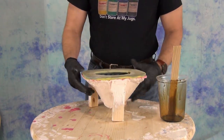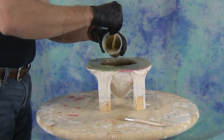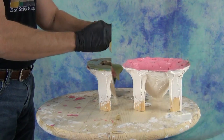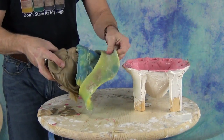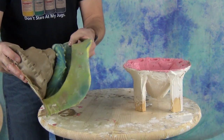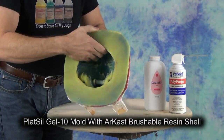Hollow casting resin with a foam backing. In this tutorial we're going to explain the basic process of slosh casting a resin shell and then backing it with a rigid foam core. This technique is typically employed for two different reasons: one, to make a lower cost part than a solid resin cast, and also because expanding foam by itself doesn't always get the same detail as a resin cast. This allows you to get the benefits of both — a resin surface and a lightweight, economical foam core.